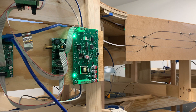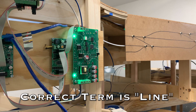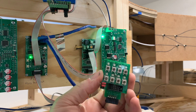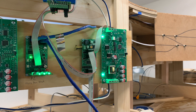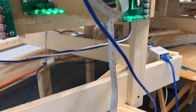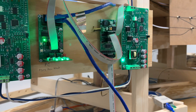When I first configured all of this, I had one channel that was not working. With my test light I figured out that channel nine was not working — the first channel after your first eight, channel nine. It wasn't transmitting for some reason, and there should be an LED associated with that when you use your test light. When you plug that in, you should have all eight lights associated with that plug lit up. It looked like one of those wasn't lighting up, and I also couldn't get anything to happen down there on the Tortoise it was configured with.